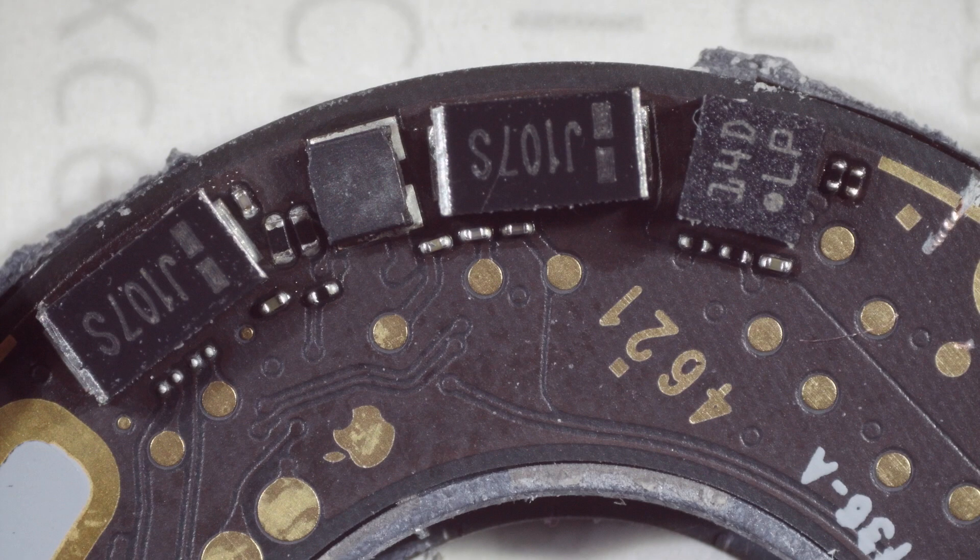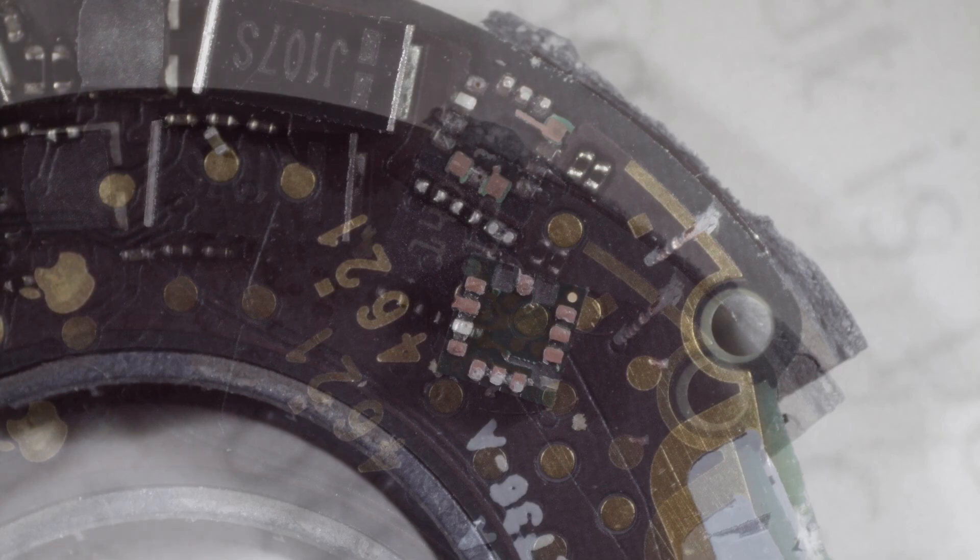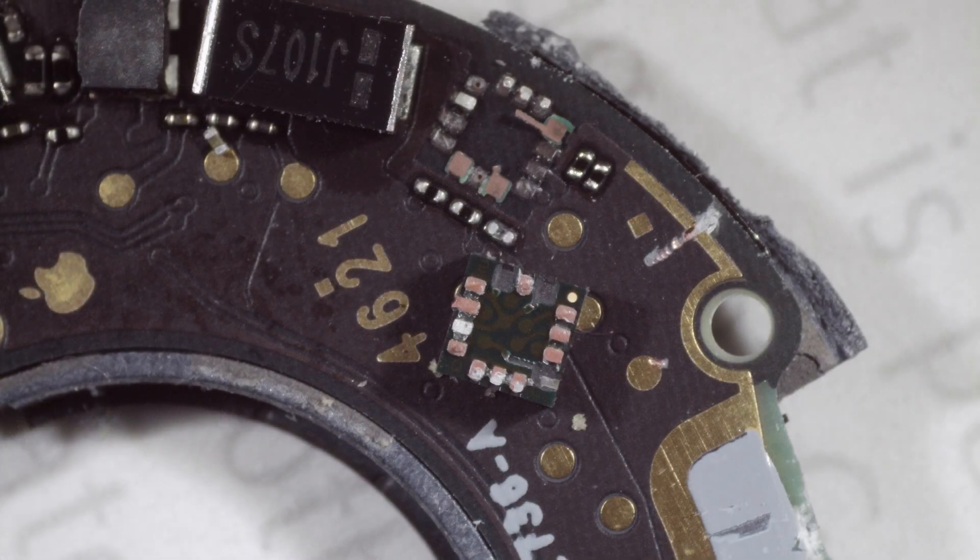If we take a close look at the PC board, there's a bunch of capacitors. It looks like an inductor. And then on the far right is the actual IC — that seems to be the only active component inside these things. It's marked 14DLP; I don't know what that is, but that's the chip. If you pop that chip off, you can see the number of pads on it — 18, 10, 16, something like that.